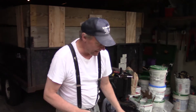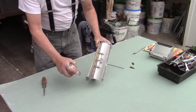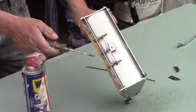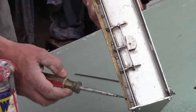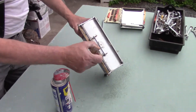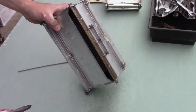We're going to change the blade on a 10-inch flat box. The first thing I like to do is make sure it's oiled up. The main thing about changing a blade on the 10 box is you do not want to damage this brass piece right here - it's very expensive. It comes off with all of these screws to replace it, and if I crack or break it, I have a problem.